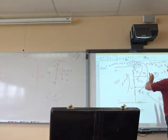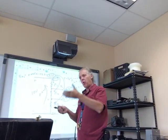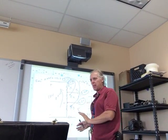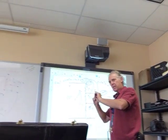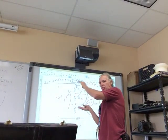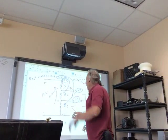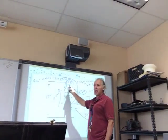So what would I use these for? Well, I might use these as just a bias voltage to hold something up that doesn't draw any current, or very, very little. So I just need a voltage to place it at 3.3 or 6.6. I can make my voltage divider any voltages, and I can even add more.